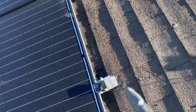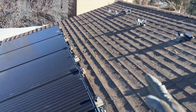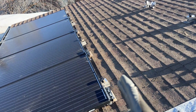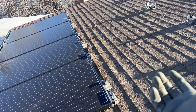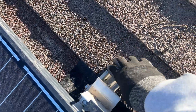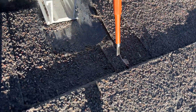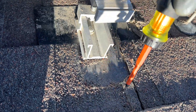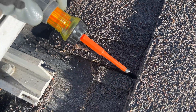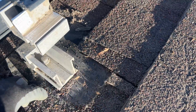I removed the top row so you can see a bit better. With the rail system, you have to have your attachments land exactly where the edges of the panels are, so those attachments land right on a course. It may be a risk of flashing it too low and having water leak, or flashing it too high — extra work. The shingles just won't look great when you notch them to slide in your bracket. You have a break in a shingle right here, and then this notched unnecessarily high. If this flashing doesn't go up past here, you have potential for water to go under. I don't necessarily love how that was done, but I see it a lot.